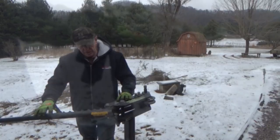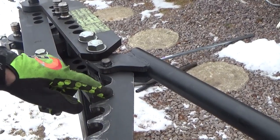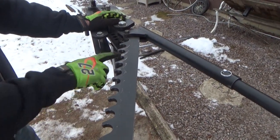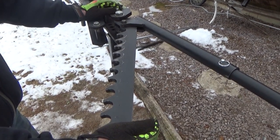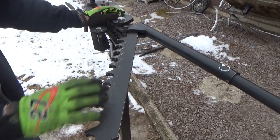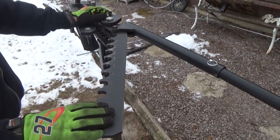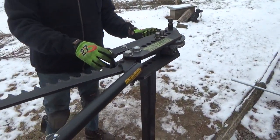What I have done is come in here and numbered each notch: 1, 2, 3, 4, all the way up to 11. So when I'm doing bends, rather than use degrees, I do everything by number. Sometimes you have to put a piece back in and tweak it a little bit, but you can actually do that - it's not difficult. All you have to do is record your numbers and you can make bend after bend according to whatever number you're using. I'll grab a piece of tubing and show you exactly what I mean.